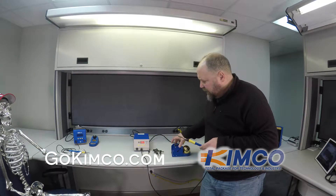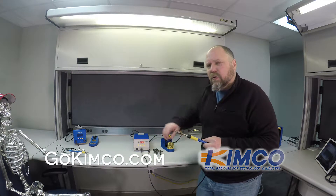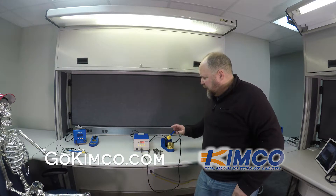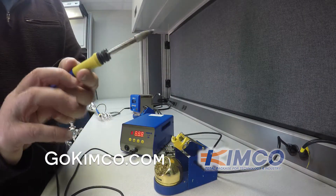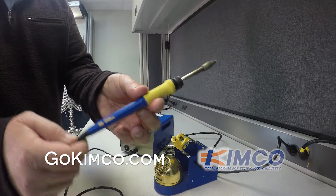There is the ability to connect this to the station via a cord of some sort. I don't know what the cord part number is, but what it would do — when you put that in there — it would trigger that switch to put it in sleep mode. That way, you're not wasting power and burning up tips prematurely.